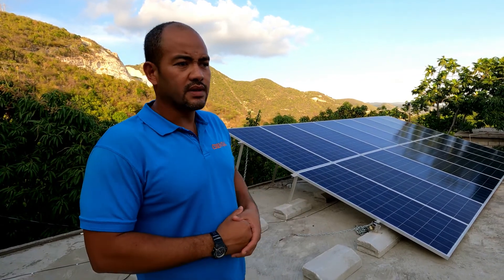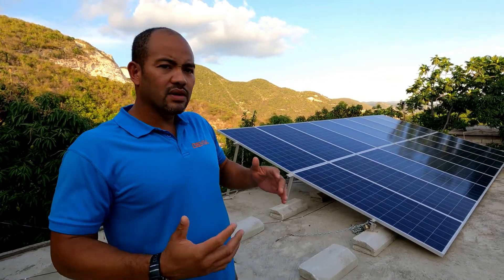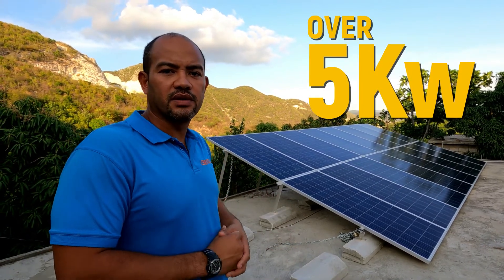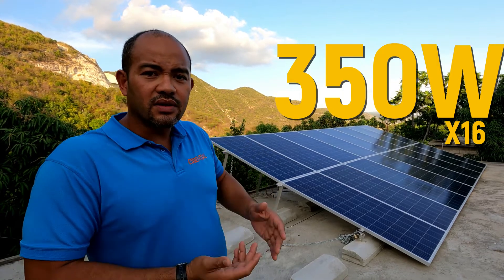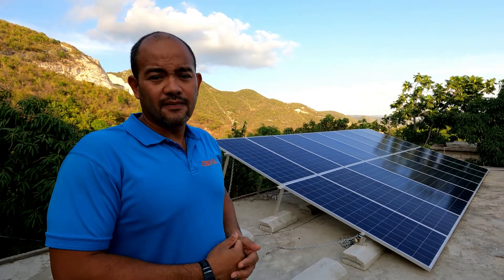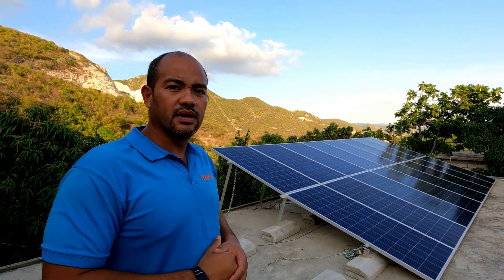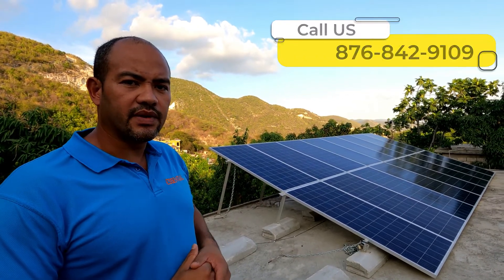Especially here in Jamaica - we're slightly in the north so the sun is in the south, so you're going to lose efficiency if panels are flat. In this case, this is over five kilowatts of generating capacity - 350 watts each panel by 16 panels. But if you don't angle it to the sun, you're not going to get anywhere near that. You can probably get 4,000 or 3,000 watts. When you angle it to the sun, it increases the wattage output because it's facing the sun rays more perpendicularly.